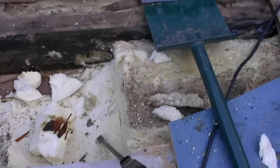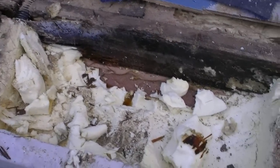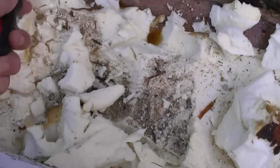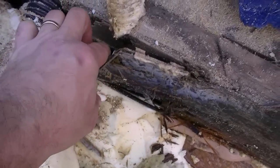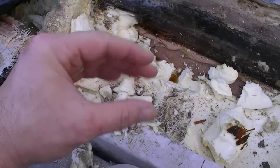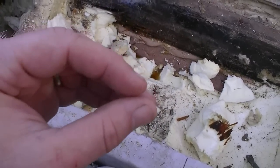There's so much foam in here it's not even funny. Foam is needed — it helps with structure and flotation. The stringers have some fiberglass on them, and you can see what causes this: water gets down in there and freezes and expands it out, then breaks the structure so more water gets in, freezes and expands out again. You can see what that water does — it makes the space between the stringers and the foam disappear as it swells up, and it just keeps little by little ruining it one step at a time.